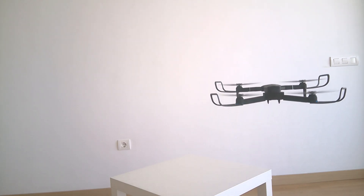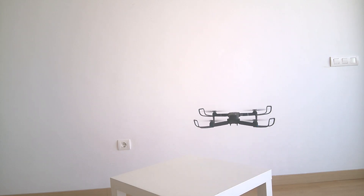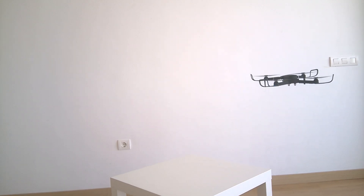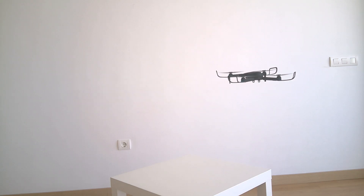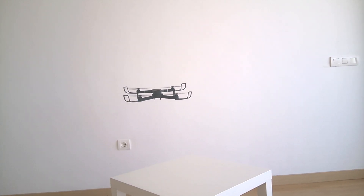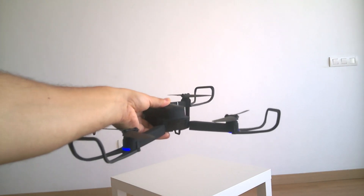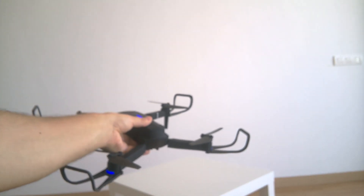You can see the drone is more stable — it's a very big drone and without a GPS signal it's still more or less stable. However, you can feel some hesitation, and that's because I didn't do the compass calibration. You can feel the drone going slightly off-axis. In order to avoid this kind of hesitation in the air, you should do the compass calibration.